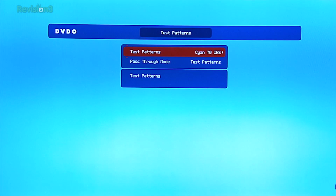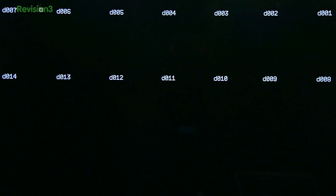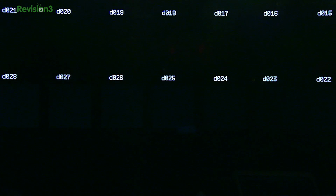This, on the other hand, incorporates dozens of built-in test patterns that cover everything from scaling, sharpness, focus, color bars, also your signal format options. This allows you to, with a press of a button, scale from 480p up to 4K and UHD as well. True 4K too, if you're dealing with a projection system that is a 4K device. Formats for refresh rates include the common ones you'd expect, 24, 30, 50, 60, depending on if you're in Europe or not. Really, the only thing I found missing was direct triplet input.